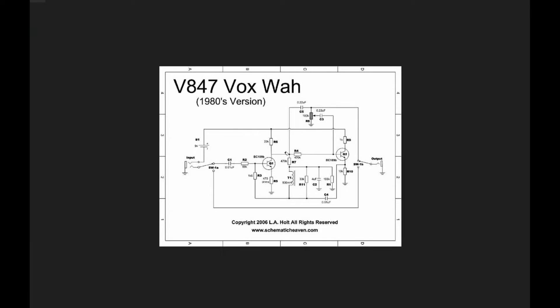This biasing scheme is similar to what we've seen in op-amps — it's a direct bias, meaning the bias of our signal is propagated directly over without a separate DC blocker and bias supply. Q2 has a 1k resistor from 9 volts and a 10k resistor to ground off the emitter. We pull the signal off the emitter, which means as our signal comes into Q2 it will come off the emitter in phase and at unity gain. There's a capacitor here that blocks the DC component of our signal but is also the key to making this circuit work as a super sharp notch filter.